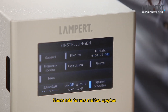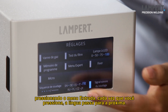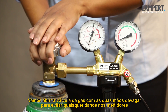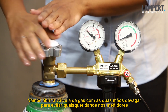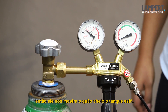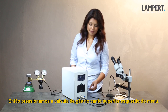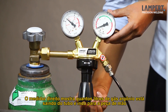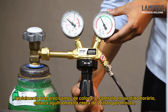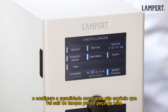From this setup screen we've got a lot of options. You can alter the language down on the bottom in the center here — that enables changing into several languages by pressing the menu entry, and each time you press it the language will skip into the next one. We need to turn on the main gas supply slowly with two hands. It is important to open the gas valve slowly to avoid any damages on the dials coming from the high pressure of the gas bottle. The left hand dial shows us how much pressure is in the tank, so that tells us how full the tank is. Then we press our gas valve upon the left top of the menu. The right hand dial shows us how many liters per minute of argon gas is coming through the tube and out onto the handpiece. We need to turn the knob counterclockwise initially, then turn the control clockwise so this needle hovers around two liters per minute. Once it's there, turn off the gas valve. That is now set the correct amount of argon gas coming from the tank into the handpiece.